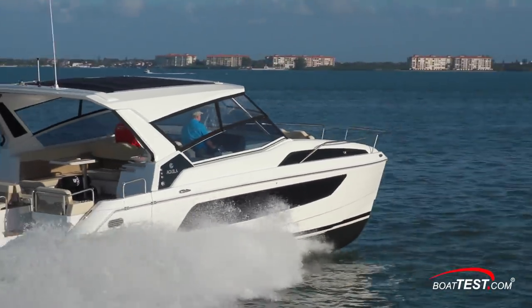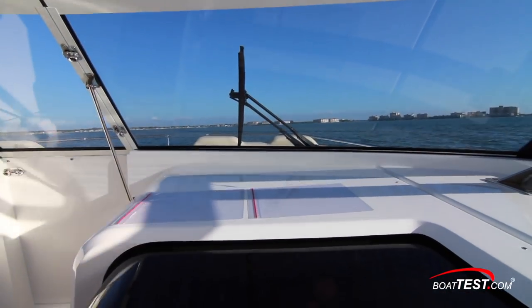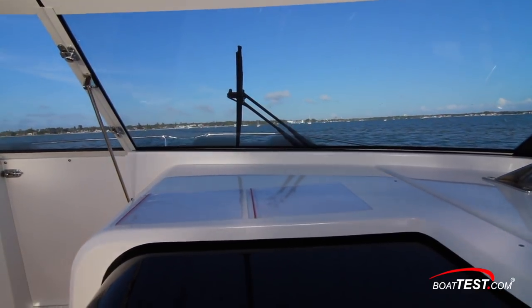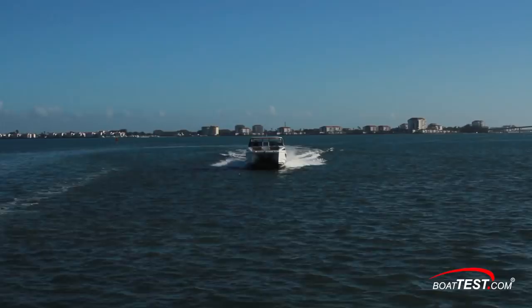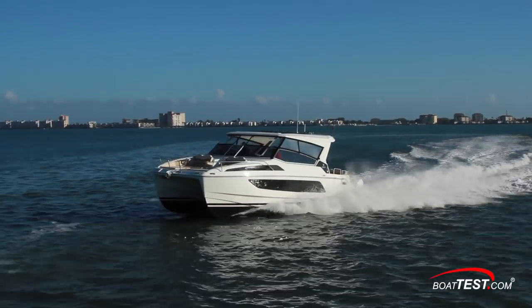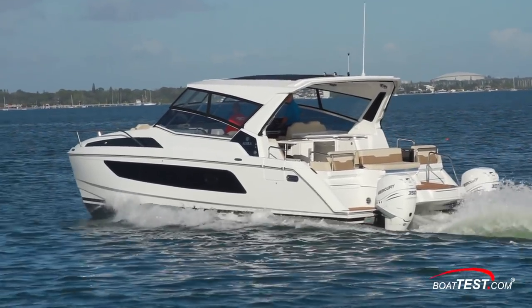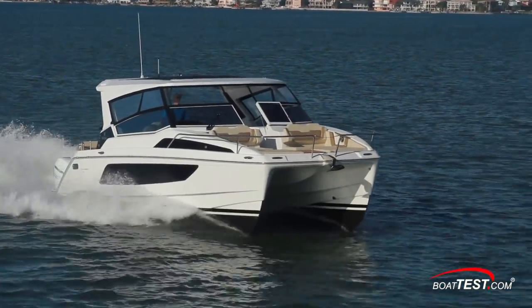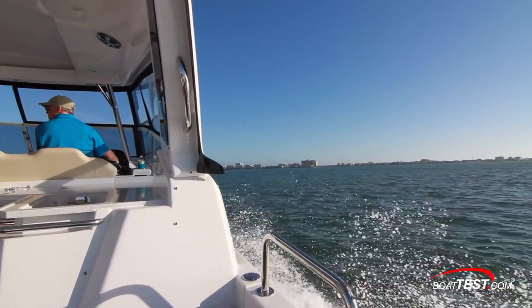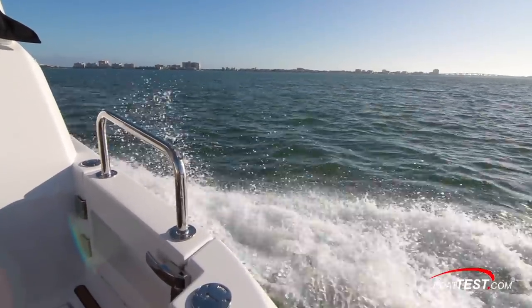The 36 is a level running boat. She comes up on plane level and turns level. With that level turning, the more land-based guests will feel more comfortable, and seasoned boaters will get used to it after roughly five minutes — then it becomes natural. There's a lot to be said for a boat that maintains a stable platform. Once on plane, just add a couple of shots of up trim to orient the props with the running angle. Her attitude won't change, but you'll move the props from traction to cruising angle. While cats are well known for good handling characteristics in foul seas, we of course had calm conditions on test day.